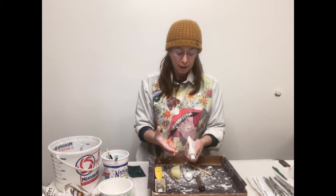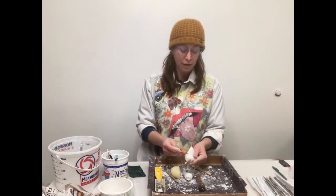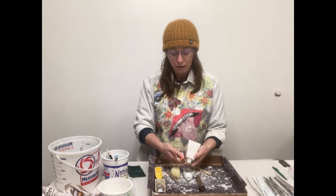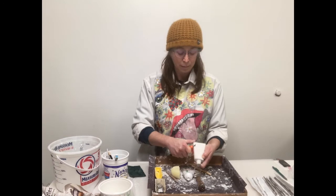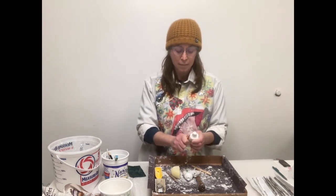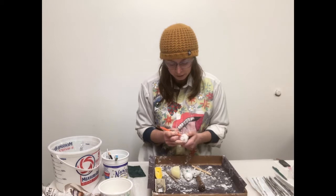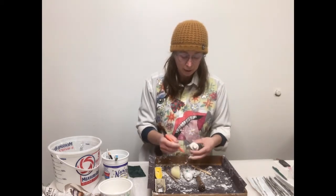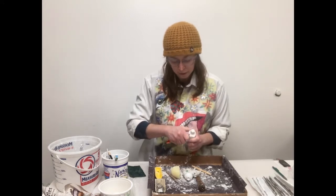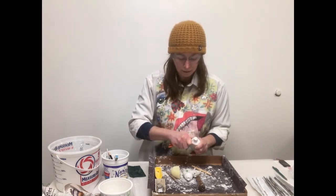When you are carving, think about where the rest of your body is in relation to what you are carving. I wouldn't just want to start carving without some kind of control. It might seem a little counterintuitive, but I actually usually have my thumb kind of at the back side of the blade, and I'm not being super aggressive with this. The idea is just to take off little bits at a time and not larger sections. This is going to be useful, for example, to get along this cap and make a nice sharp distinction between those two planes. It's just slow little bits — you're never trying to take off big chunks.